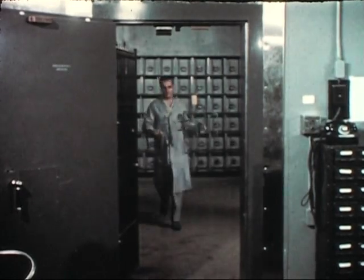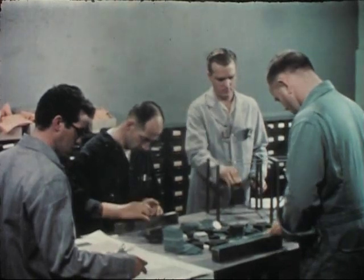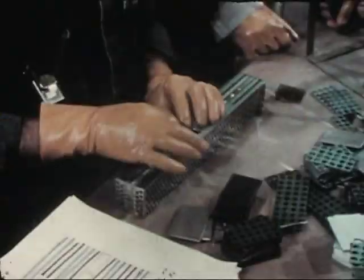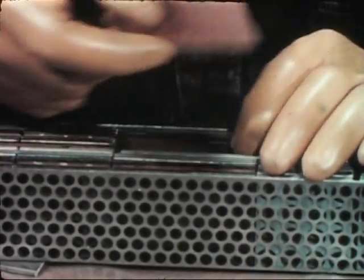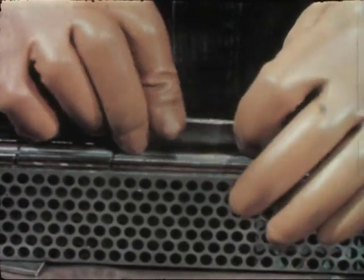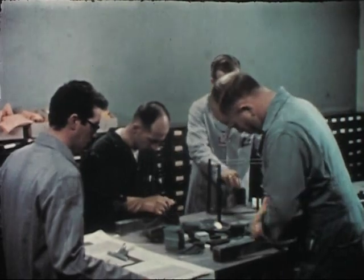The highly enriched uranium-235, in the form of one-eighth inch thick plates, is color-coded red to distinguish it from the depleted uranium which is black. Only two drawers may be loaded at any one time on the loading table. Since the distribution of materials in a drawer has a pronounced effect on reactivity, the desired arrangement must be maintained. The drawers are loaded according to their corresponding drawer masters, with uranium as the fissionable material, stainless steel as the structural and cladding material, and low-density aluminum to represent the sodium coolant. Aluminum has been selected to represent sodium because of its similarity in cross-section for fast neutrons.